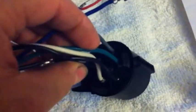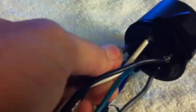The pins will just flop all over the place, so watch which ones you pull out so you can put them back in the right spots. The ground wire is green and goes on the bottom pin, then you've got line one and line two. The harder ones to figure out: the one on the right side is gray with a purple stripe, and the little one on the other side is black with a purple stripe. These pins are soldered.